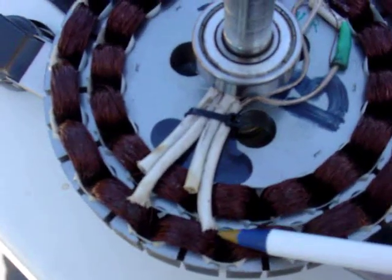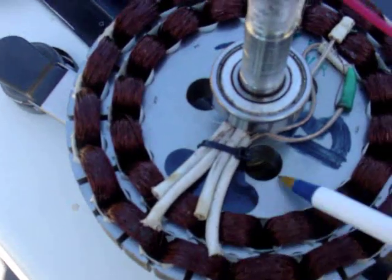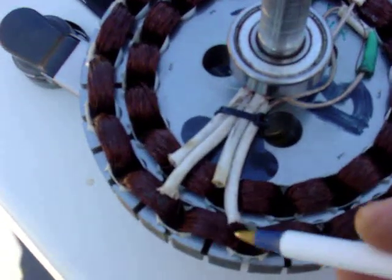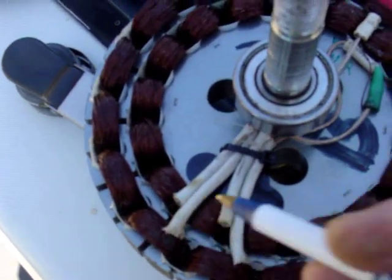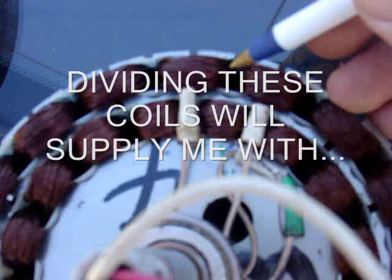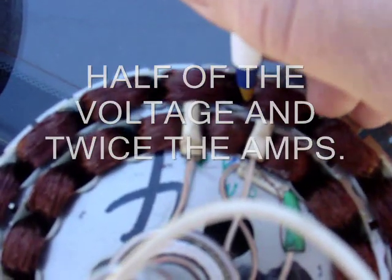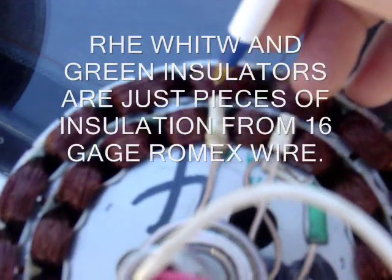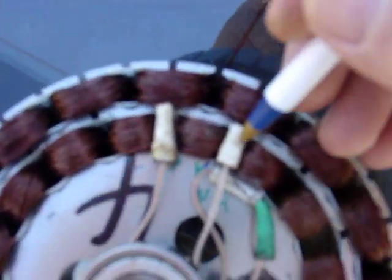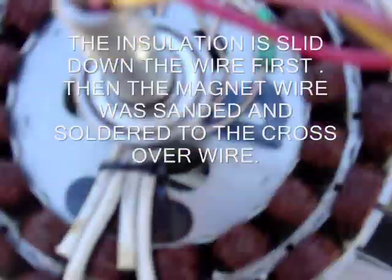I couldn't help but taking where the wires come in here, running it through here. I've already pulled it from the other side on out, and this is the inside of the coil and the outside of the coil, which I have wired over here. I went halfway across and found where the wire crosses over from the outside of this coil to the inside of this coil over here. I took one wrap off and wound up connecting here and here, and the same thing with these two on this set of coils — I wired them over here.